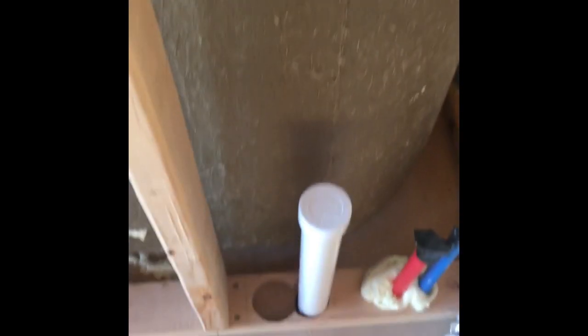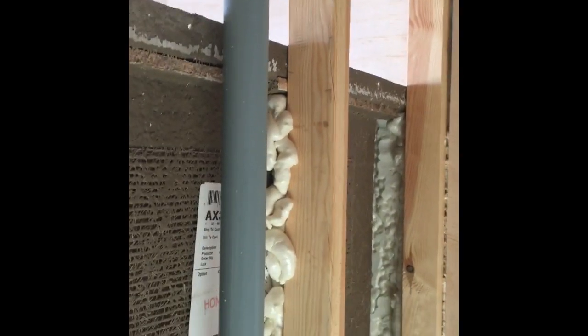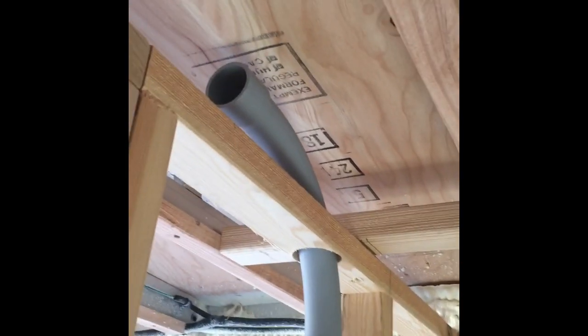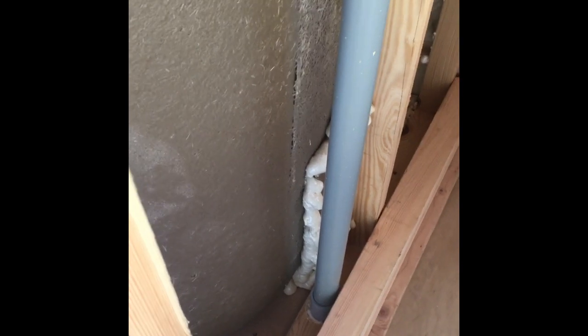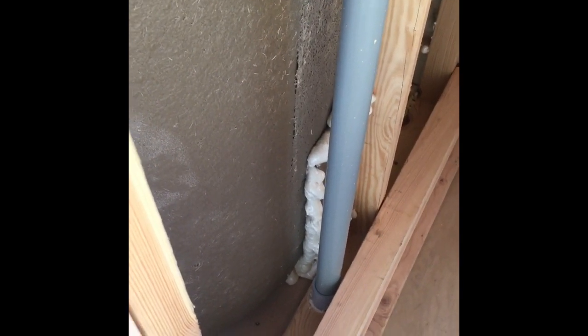And then my other vent pipe, I'm gonna drill through and run it on up through the ceiling. There's gonna be a TV mount on this wall because right here's the bed, so I'm gonna beef up some blocking in there. I'm gonna put another blocking around my utility pipe that goes down to the bottom of the trailer and out the bottom. That's for my tank monitoring wires and any other wires that I would like to ever run to the bottom of the trailer. I've got a point to do that at right there. There's also going to be one behind that wall in the utility room.